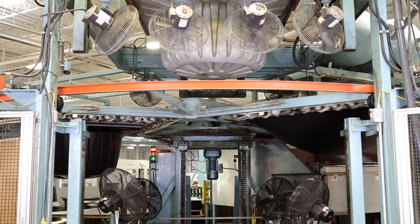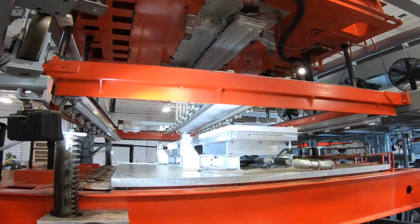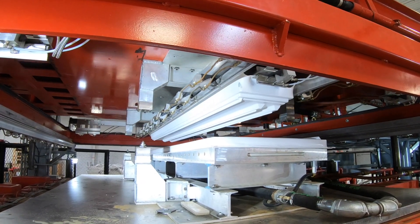It's great to hear another part guru company that's cutting edge. What else keeps you state of the art? The machine behind me is a brand new piece of equipment — a European design zero sag machine. When you heat up plastic, it creates a sag at its melt transition point, and when you're doing a very shallow draw part, it's very difficult because the material stretches out. With the zero sag machine there's no sag at all. Any pressure forming or twin sheet forming done with the zero sag will allow us to control the thickness of the part precisely — which is critical when you want some areas thick and some areas thin.